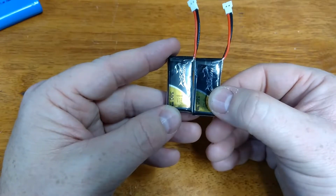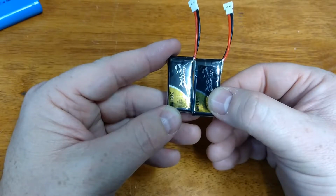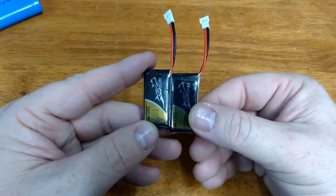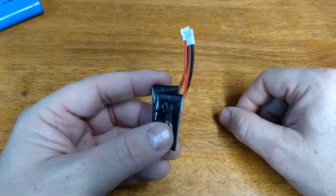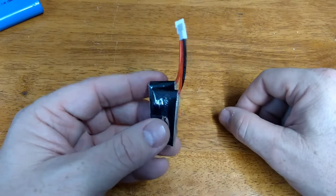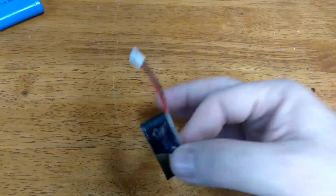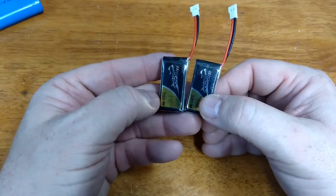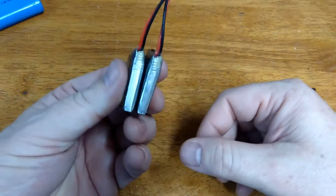Now if you wire in parallel, you get twice the milliamps per hour. So you would have 760 milliamps per hour instead of 380, and the whole while you'd be starting at, I'm sorry, you'd be starting at 4.2, because these are fully charged, one battery, 4.2 volts. So you would be pushing 4.2 volts for 380 milliamps per hour. And so you can run your camera with 2 of these.